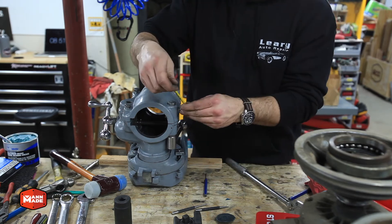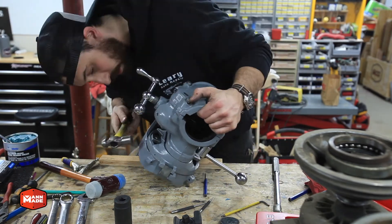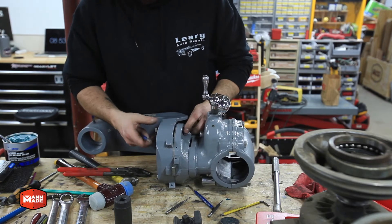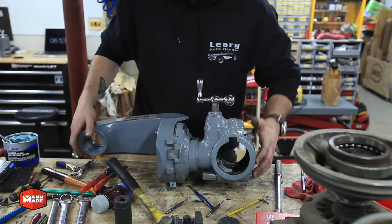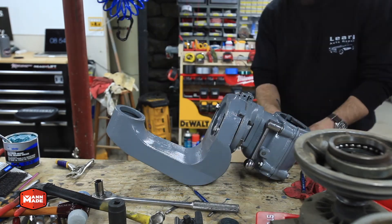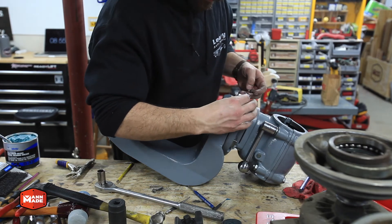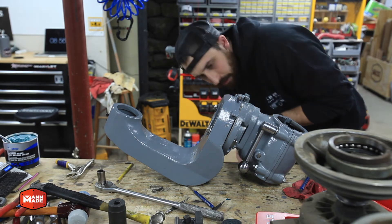I replaced the knob on the handle with a stainless steel metal ball — I'll be using those on the drill press head as well. Now I'm tapping the pin back in place. I realized I made a minor error, so I took a bolt out to use that bolt hole with a punch to position the pin correctly — it would have been easier to put the two pieces together first, but here we are. Ensuring proper gear function in the gear case, then putting in the adjustable screw stops, which work with the flip-down indicator to give positive stops at 90 and 45 degrees both ways.